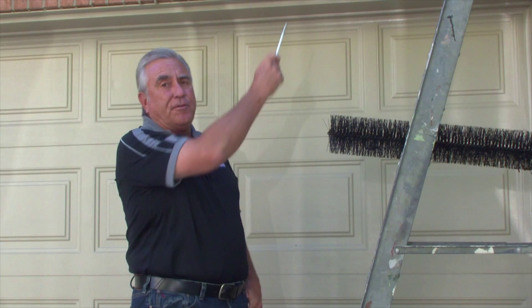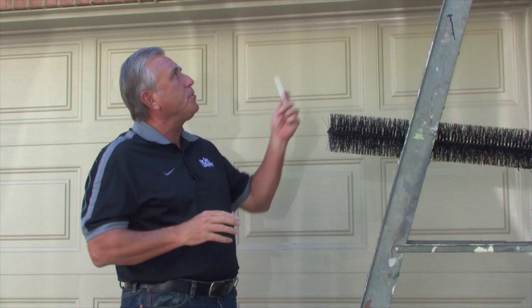Here we are on the side of the house — whatever side you're on, there's a lot going on in this area. The first thing I like to start with is the soffit vents. The soffit vents are venting in the overhang of the roof. Their purpose is to bring cooler outdoor air and funnel it into the attic where it's very hot, and then your ridge vent will allow the heat to escape. All that means you're going to save money on your air conditioning bill.